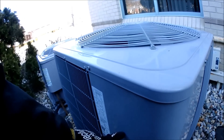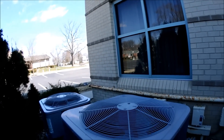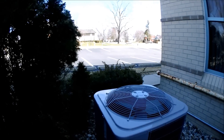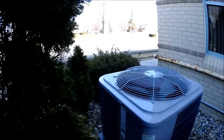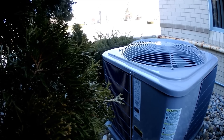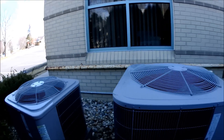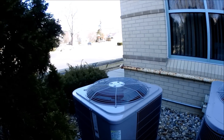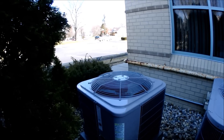It's got a little switch right in here that turns the fan on and off depending on pressure. I've been doing maintenance out here for years. This is a 410A unit that got installed in 2016. This other one is an R22 that got installed in 2009, but we just installed this one I think two years ago. It never really occurred to me that it didn't have a fan cycle switch on it.